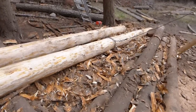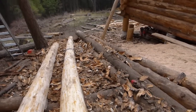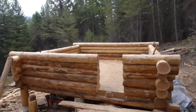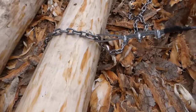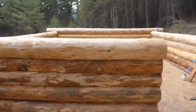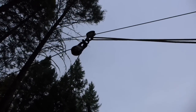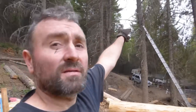Several hours later, lunch in our bellies and peeled logs — we're ready to do our lift to get these guys onto the platform. You can see I've got the standard normal hookup right in the center on the cable, and hopefully you can see I have two snatch blocks on a d-shackle, with the cable coming from one tree in there to this tree up here.